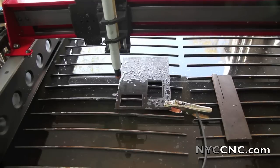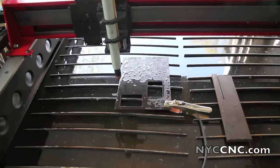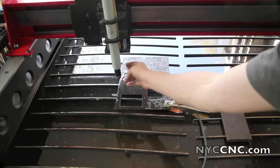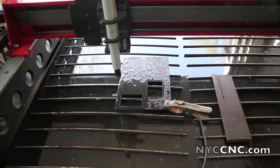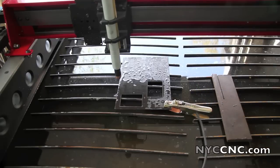A couple of tips I've already learned along the way: don't worry about water on the plate — these machines are not going to be affected by it, and when it's cutting it throws water all over the place. When I first started I was paranoid about causing a short, but not to be concerned. Another tip: sometimes the consumables are actually too tight from the factory. All you need to do is loosen it and bring it to finger-tight, just barely to where it stops — you don't need to torque it down at all.